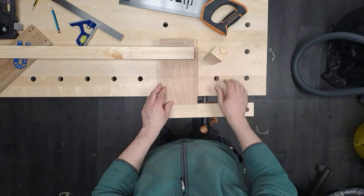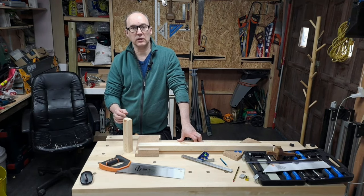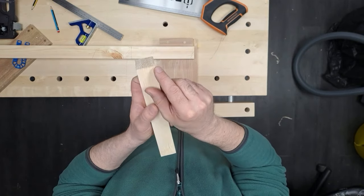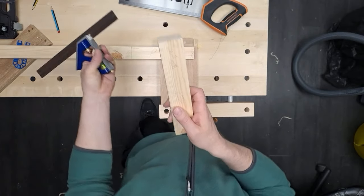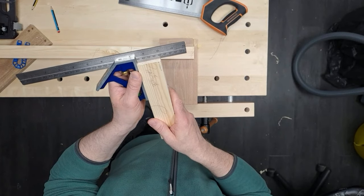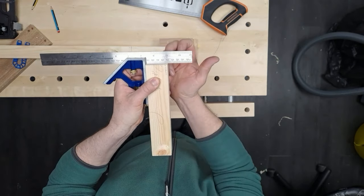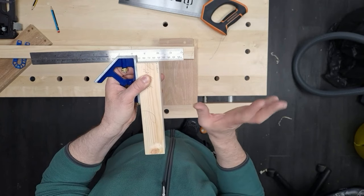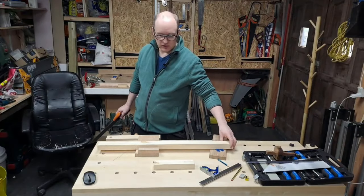If we can put that timber upright and it stands straight up like that, we've got a pretty straight cut - but we're going to check it a bit closer. If we take a closer look we can still see a fraction of the line left all the way around - that's fine, that's what we're looking to do. For closer inspection, take your combination square and put it up to that and see if you can see any gaps. If it's within about a mil that's okay - we can tidy it up afterwards. I'm happy with that, let's cut our second piece.